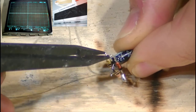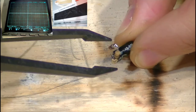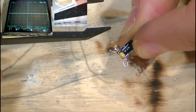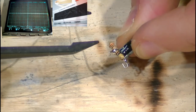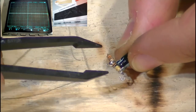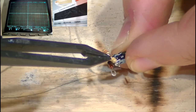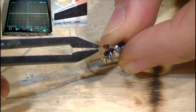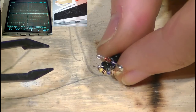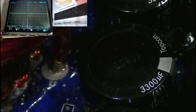The 5-volt signal is going to go through the diode. It's able to pass because we have it in this orientation. It's then going to go through this 10K resistor, which limits the current drawn from the 5-volt line, so it doesn't charge the capacitor too quickly, which would drop voltage across the 5-volt line, which we don't want. Then we have a 100 kilo-ohm resistor, soldered across the capacitor, which drains it slowly when the 5 volts disappears from the diode. So that is all we need to add a soft start circuit to this amplifier. Let's see exactly where it fits in the board and see how it changes operation.